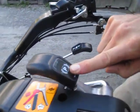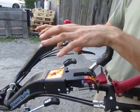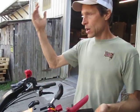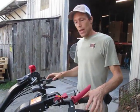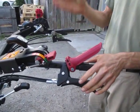This is your parking brake. If you pull that back, it locks both the drum brakes — right and left — which is useful for parking on a steep hillside, putting it in a trailer for hauling, or whatever. It's just a nice way to stop both wheels at once. These levers on the outside are hooked up to the individual right and left drum brakes, and they're used for steering.